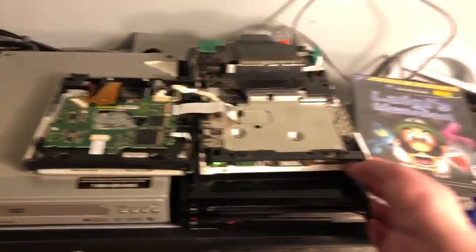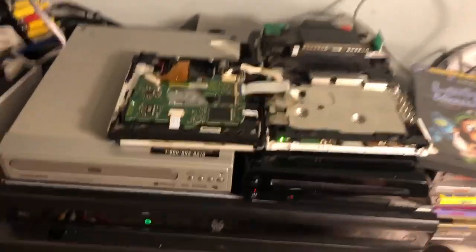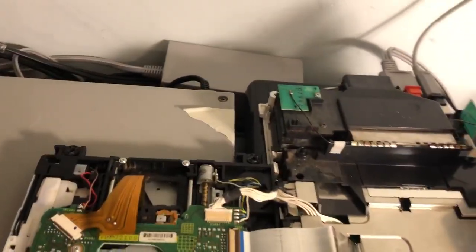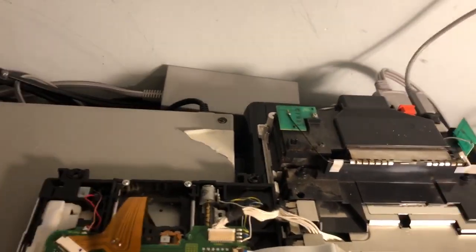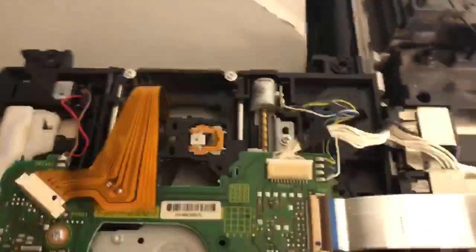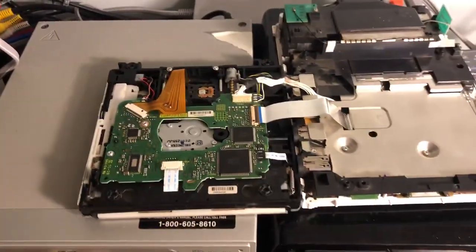So that is the strange behavior. Sometimes it doesn't recognize the disc at all — it'll just do a few clicks and doesn't spin. It has nothing to do with the shield being missing. I desoldered the anti-static shield, and I even tried soldering it back just to see. I tried adjusting the pots — it does nothing. This is just a defective laser they sent me. I'm just surprised at all the strange behavior it does.